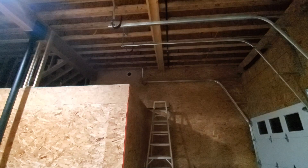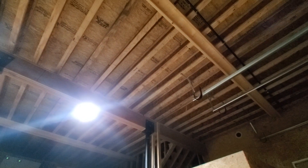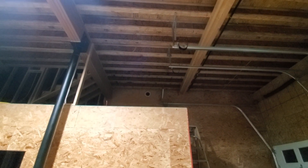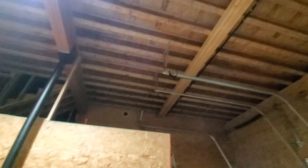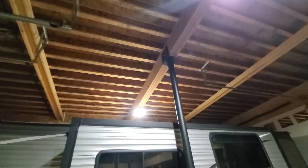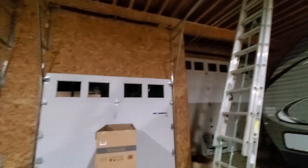Getting pretty close, but still a lot to do. That vent up there is from the back side of the pellet stove and I've got to run duct work down through there. It's almost perfectly centered where it needs to be. I'm going to have to go off to the left about a foot to hit the edge of the wall where the girls' rooms are. I need to put my three taps in — Valerie's room, Sydney's room, and the master bedroom. While the pellet stove is going, we can turn on our auxiliary fan.